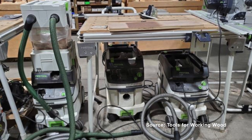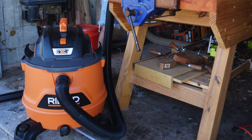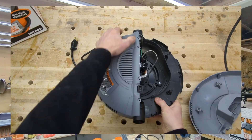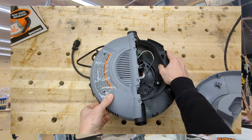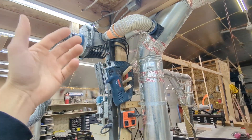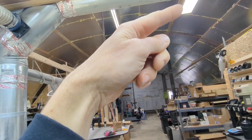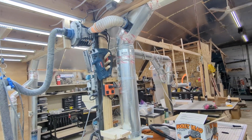The most common solution is to buy a little shop vac and put it next to your workbench. But I didn't want something kicking around in this space. So I decided to hack apart the cheapest shop vac I could find — one of those bucket head things that Home Depot sells for a five-gallon bucket. That way I'd get good suction through the small tubes, and instead of having a second filter and canister, it just pumps the air into my large dust collection. But now that it's died, it's time to make version two.